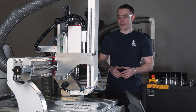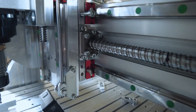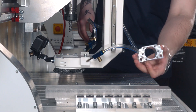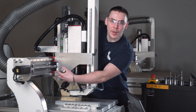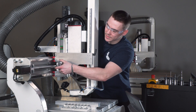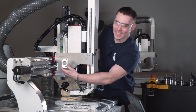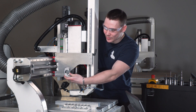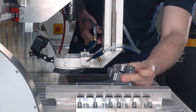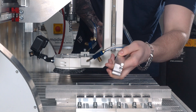My name is Rauno and today I have a challenge to make very important parts for this machine. This part is called a ball nut housing. What it does is it connects to the tower and to the ball screw. The ball nuts and ball screw go in here, so basically when this moves it also moves this part, which is attached to the tower, making the tower move. It's a very important part for the X-axis movement.